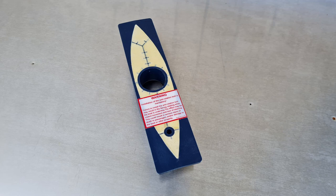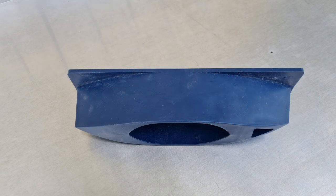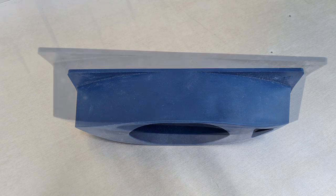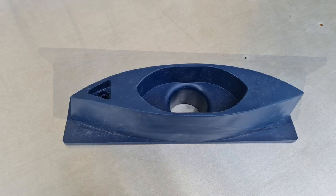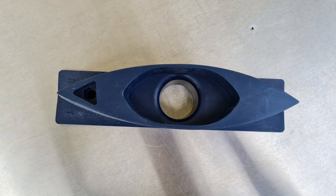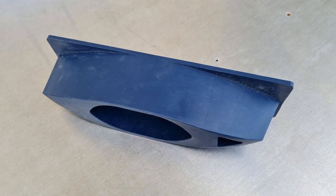The thru-hull transducer I got comes with a fairing block, but unfortunately that fairing block won't fit my boat. The space between the hull I have to cut out where the transducer itself comes through and the anti-rotation bolt at the front of it isn't enough to fit in the structure of my boat where I need to put it. It's just too close together. Anywhere I can put the transducer through the hull means that that anti-rotation bolt is going to come up through a cross member, which is about 5 or 6 inches deep, is probably foam filled, and I'm not sure how thick the glass is, so I don't want to put any strain on it. I don't want to drill through the foam because that means I've got to seal it. All sorts of considerations there. So I decided I'd make my own fairing. And so the first part of this project is about making that.